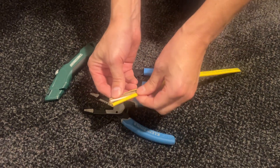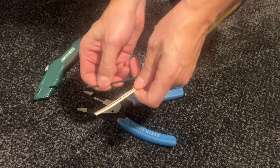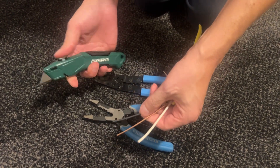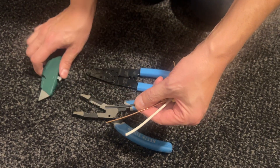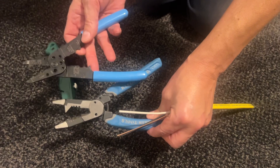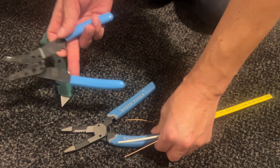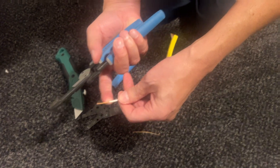Forgetting to use wire strippers. When you're working on electrical wiring and you need to pull back that insulated sheathing, some people will look for any kind of knife or whatever they can find, and you will cut and damage the wire. It's always best to use wire strippers dedicated for that task. This is an inexpensive wire stripper that will still work, and this is a professional grade wire stripper — clean and smooth, no damage to the wire.